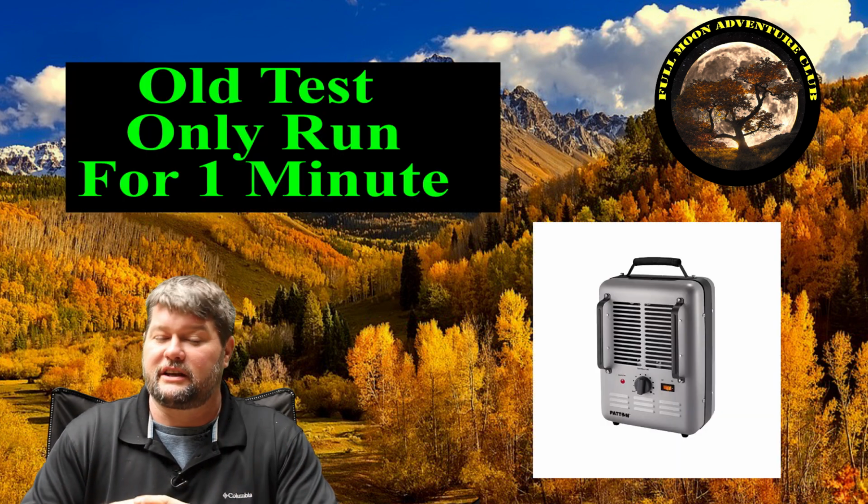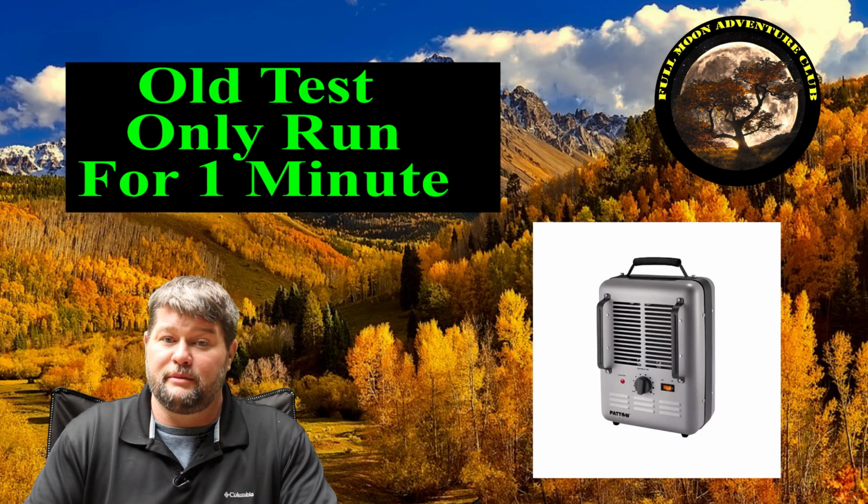And I've even tested that heater in one of my old reviews where I said it will run one of these heaters, but then I go on to say, this is not what you want to run this heater with, because of course it would drain the battery in 20 minutes. I think that's what the math works out to. It's got 1,100 watts of capacity, and you're running 1,500 watts pulling out of it. It's probably only going to last about 20 or 30 minutes. But this one shuts the battery off, so you don't discharge it that fast.